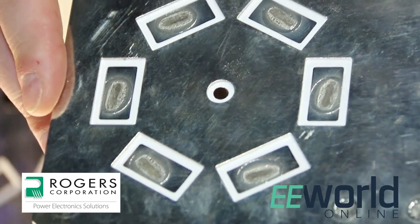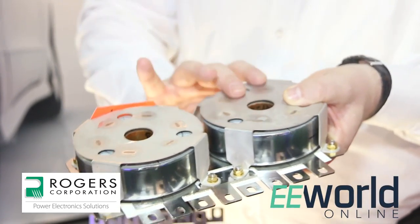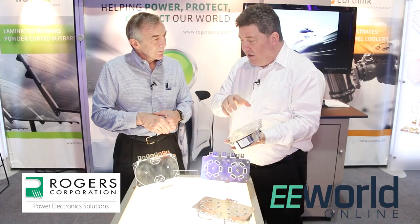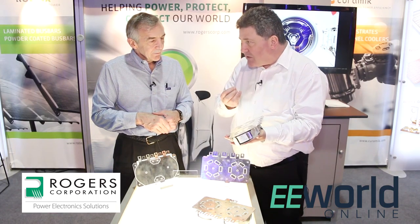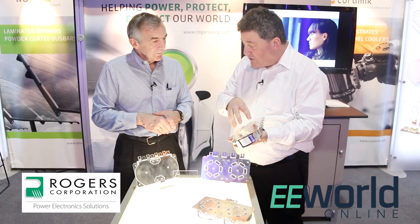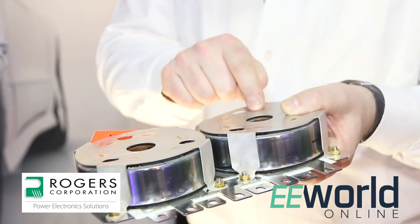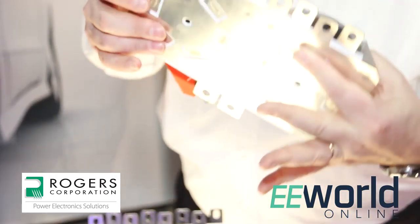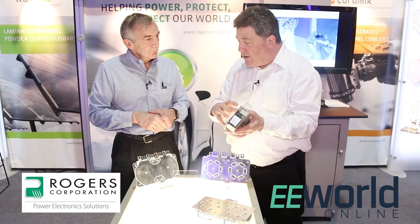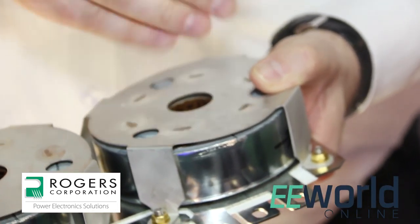I noticed these are spot welded at multiple sites on this side, and there's also an interesting cap on the other side. Is that an advantage? The typical capacitor has only one connection port for the plus and one for the minus. Here we have multiple connection points for the plus and for the minus, which means you avoid hot spots — if you're running 400 amps through a terminal, having multiple terminals avoids generating that heat in the first place. The other side is connected in a similar way, and you could even put ring capacitors on both sides of the bus bar, creating a very dense, compact inverter solution — something you can't do with any other capacitor because a mounting stud prevents it.